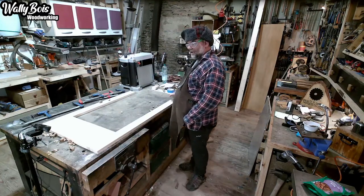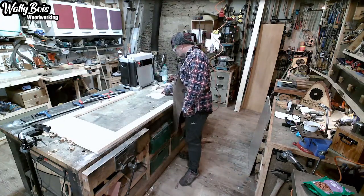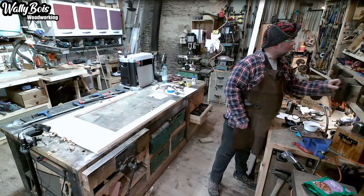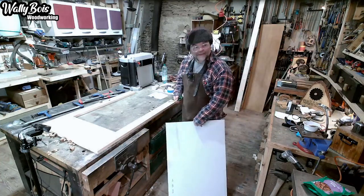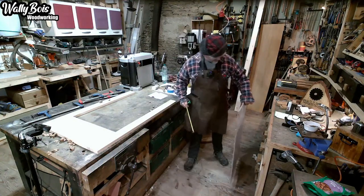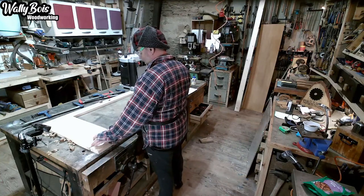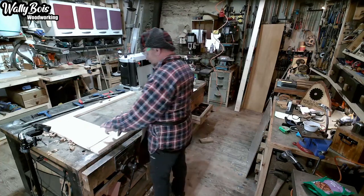So at the moment, as you can see, that's too wide, right? But the height I've got for the actual dry white board, which I did write down, is 860. I'm going to just double check that, make sure that I'm not making mistakes already. That wouldn't be the first time that I have. So let's just double check that is 860 thereabouts. Yeah, 860. Plus I've got to trim it a little bit as well, and the width is a bit wider than I need, so not too bad. What it does do though, it allows us to have more joint area, to make a stronger joint. So that's what we're going to do. But first of all, I need to rip these down to size.